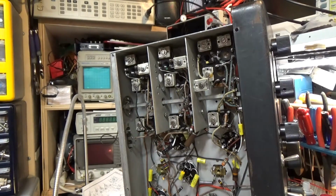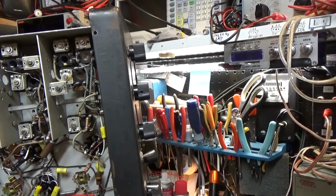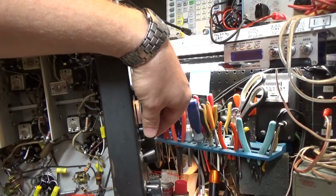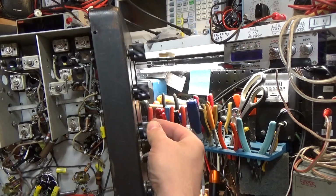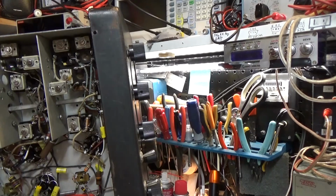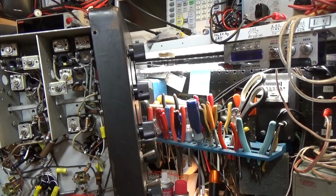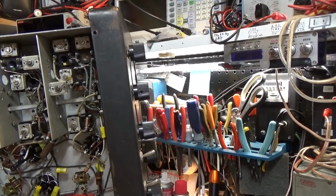And you can see I'm at about negative 30 dBm, so I'm putting a pretty strong signal in there. Then we're going to put CW, and we're going to turn this down in case it's loud. If this works, we should be hearing a tone, which we don't know if the BFO is working or not. So let's rotate this and see what we get. Hear that? Let's turn it up a little bit. Hear that? So if I go above or below my 455, I make that sound.